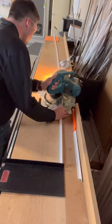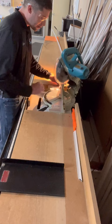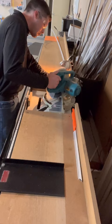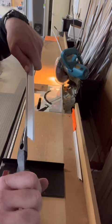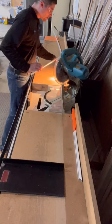Keep my finger here, other hand up here. Okay, I got my cut. I have my extra piece over here, and now I'm going to flip this piece over because I need to make another 45-degree cut. Sometimes when you flip it over, it might get a little bent in the track — that's just this saw. I take a needle nose pliers and clamp it right back to normal. You still have a really nice cut.